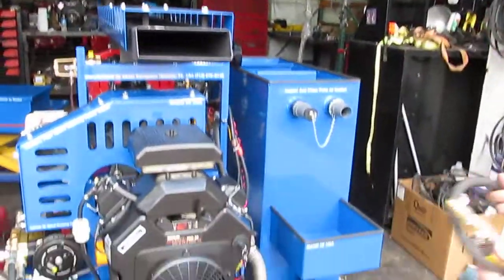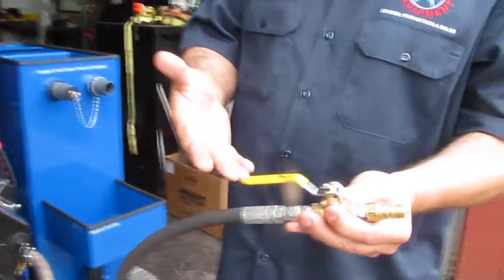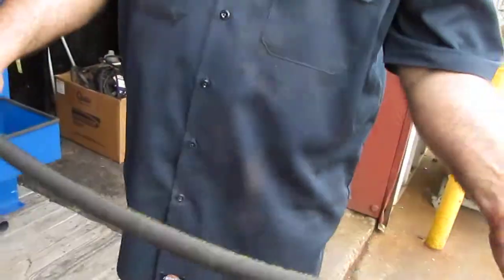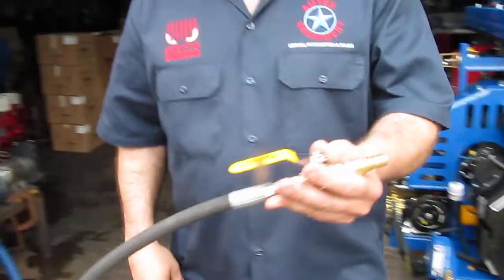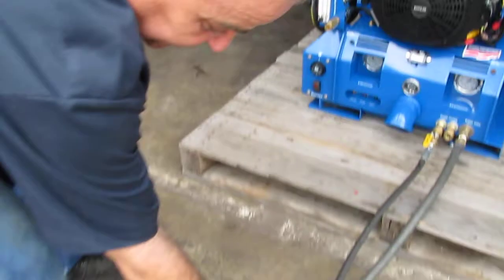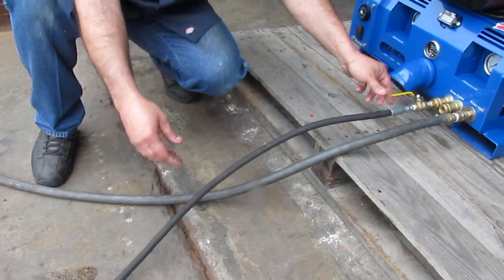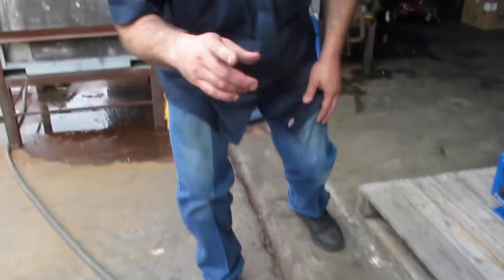Every machine comes with a jumper hose, which is a combination of a quick connect, a ball valve, and a hose. Every time you turn the machine on, some of the water inside the plumbing gets drained out, so you do get a gulp of air going in. Prior to startup, you want to make sure you drain all the air out of the system by simply connecting this hose to the front end of the machine. You'll be able to see the water start pouring out because the valve is open.